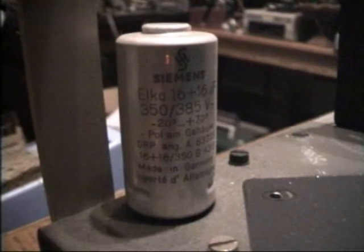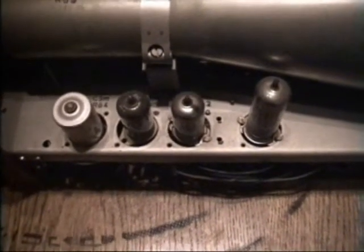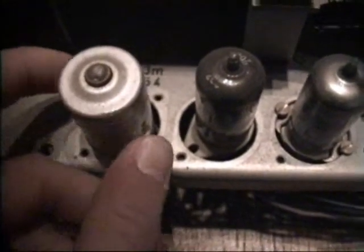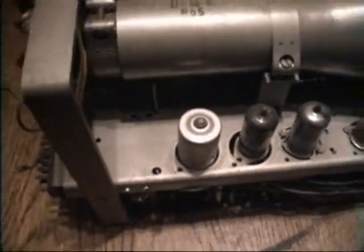This is the back side of the unit. This one right there is an electrolytic capacitor — it has a capacity of 2 times 16 microfarads. Here are the tubes, and it really looks like the unit was designed to use different types of tubes, because there used to be a different socket in there and the sockets for those tubes have been put in later. And as you can see, it says there should be a tube in there, but there is an electrolytic capacitor just sitting loose.